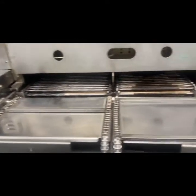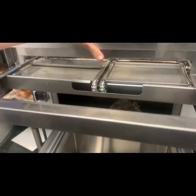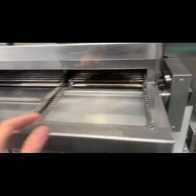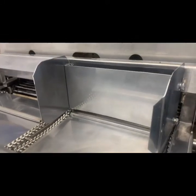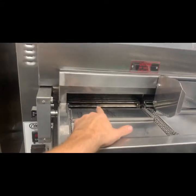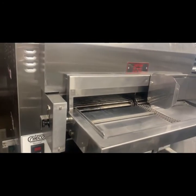I actually don't like how sloppy this chain is - I'm going to tighten that up. Now we're real close. There is a slide here that goes on the front, and then you have your scrapers - a short and a long - that go there, and that's what scrapes one burger at a time in. The last piece will be this decorative front which uses these pins and hooks - you just set it on and it slides right down like a picture and it's on. There we have the assembly minus the food pans which set in the bottom, but from the mechanical side, that's that.